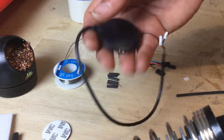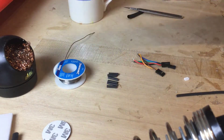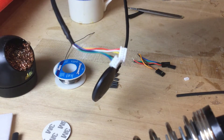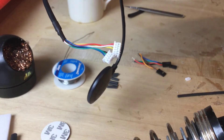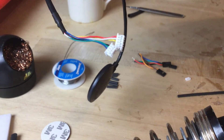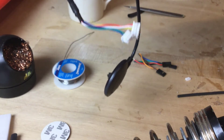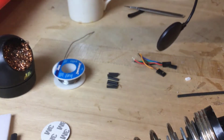That's especially important for the compass which is actually mounted on the bottom side. What we're going to be doing in this tutorial is — see those wires just there — those are the wrong connectors, and we need to put on our own connectors so we can connect it up easily to our flight controller board.